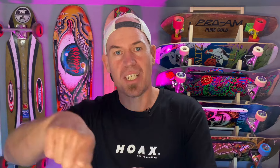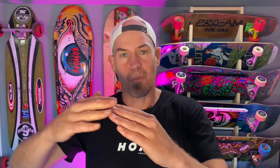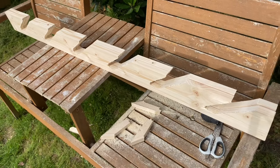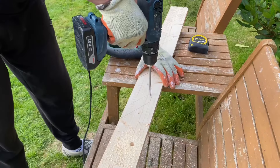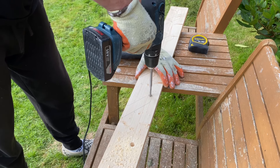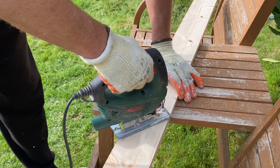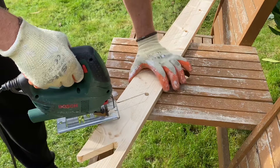To make sure both sides were identical, I simply traced around the first side I created. This would mean that hopefully the boards would not sit at a jaunty angle — any sort of jaunty angle plays with the OCD, so it needs to be straight. To get a nice rounded bit where the boards slot in, I used a drill to give me a nice round circle. It also gave me a good place for the jigsaw to finish its cut, as trying to get that circle with a jigsaw would be a little raggedy and place too much strain on the blade.